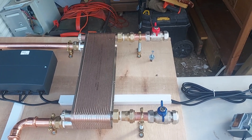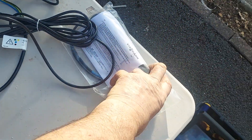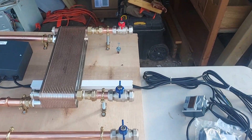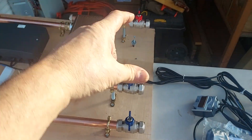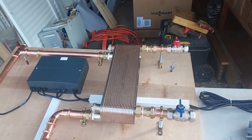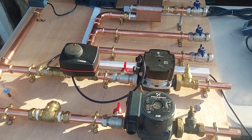This will be priority domestic hot water, so I have a cylinder sensor here and it's four-pipe, so that will be just connected down to the cylinder. These will be the two heating pipes and the hot water will be on the other side.